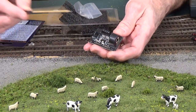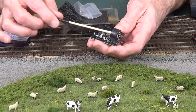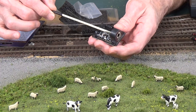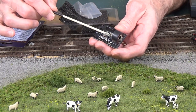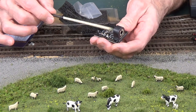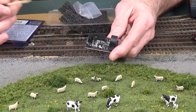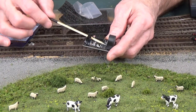It's got four different output connections where you can connect output wires to run relays and logic circuits — the whole nine yards. You can use this to power LEDs that light up on your control panel when a locomotive is active in a given block. They're a very reliable approach. Unlike diode-based occupancy detectors, these take no power from the rails themselves. Typically with a diode-based occupancy detector, you're going to lose somewhere between 0.7 and 1.5 volts, whereas with these, the current passing through just induces a current in the coil inside the device.